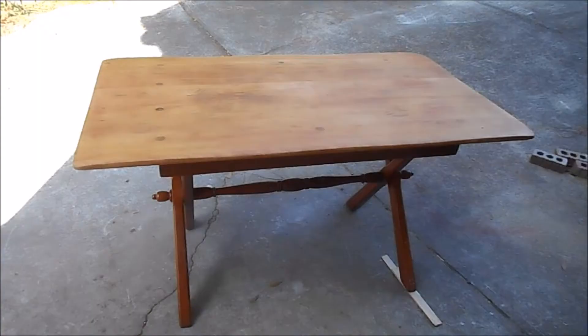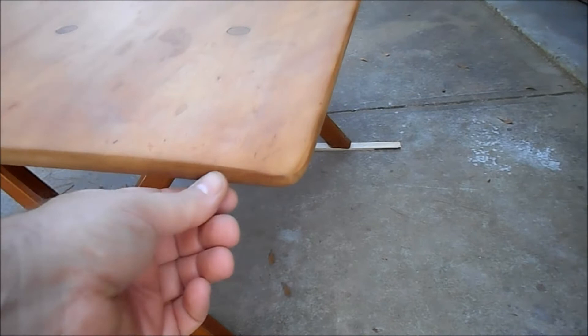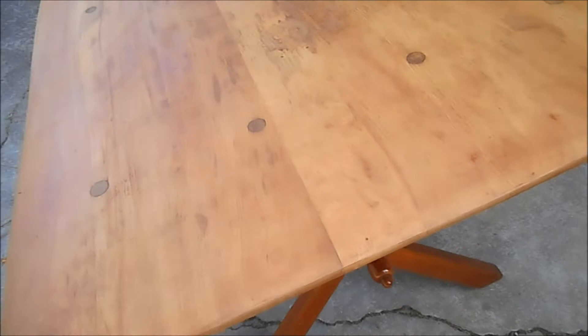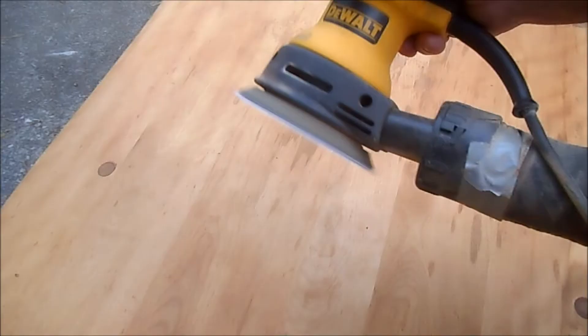It's all stripped off and it's in surprisingly good shape — absolutely beautiful table. One of the things I like most is the proportions; look how thin it is, it makes it look very light and airy. As we suspected, the top is stained but not damaged — no putty fills or anything like that. What we have is this kind of pattern you see when finish breaks and then water, air, and gunk get in there. This is exactly why it's so important to refinish furniture when it starts to go.